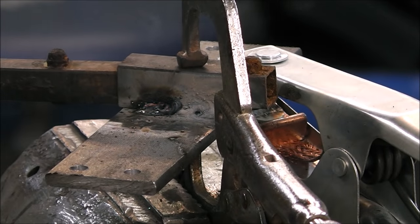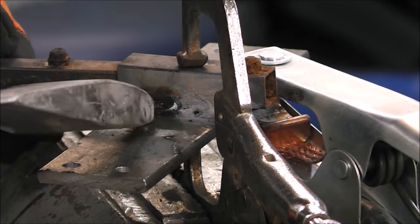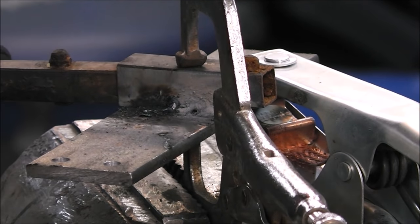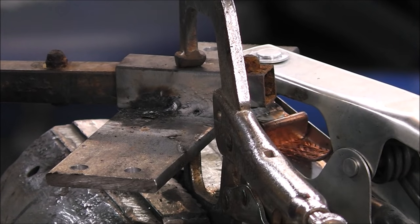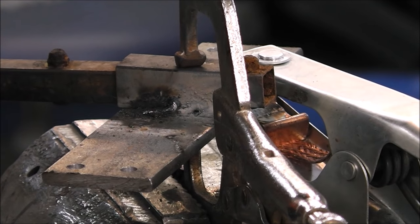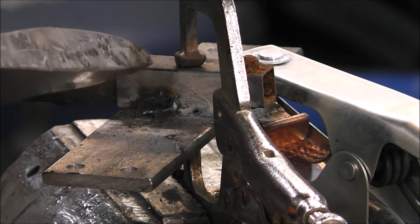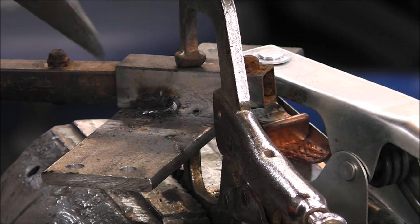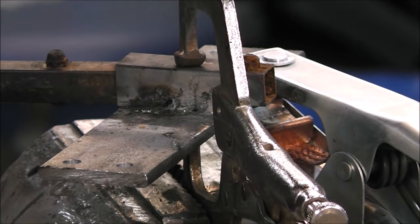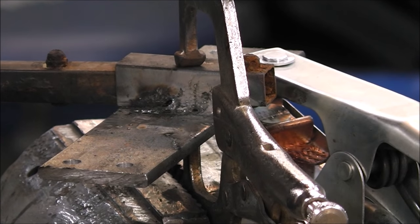So what I'm doing, guys, is I'm focusing almost all of my rod angle into the heavy plate so that the plate is actually what's kind of like washing back into this so that it doesn't burn it through. Trust me, this won't be pretty, but it'll hold.